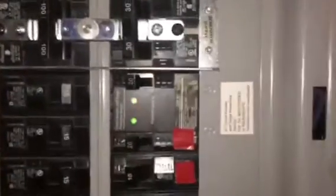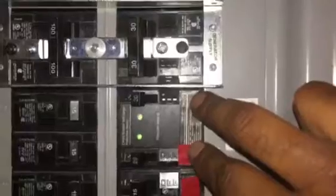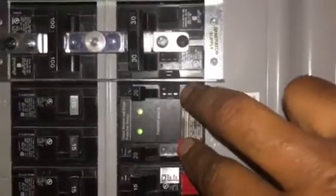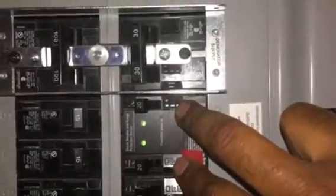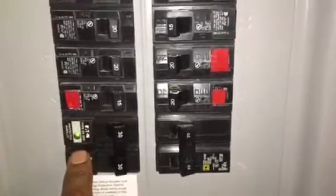Also, just wanted to highlight that it's pretty important to have some type of lightning protection or surge protection. And here I have three, I think of this as 3 levels of surge protection. I have it here for power coming in from my inverter charger. I also have circuit protection or surge protection here, and I also have another whole house surge protection in the main breaker behind the panel. So right now I'm back on solar, and let's go take a look at what it's saying.